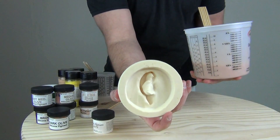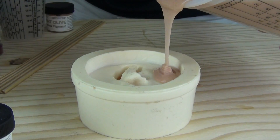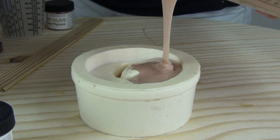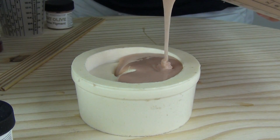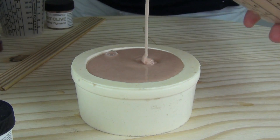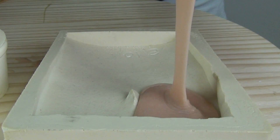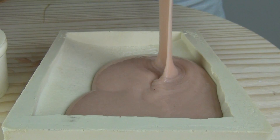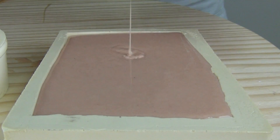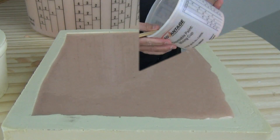5110F is a very low viscosity silicone with a mixed viscosity of around 2500 centipoise, so most parts like this we don't have to vacuum degas. But if you're doing really critical medical simulators, silicone dolls, and masks, it's always a good idea to vacuum degas — and there's more than enough time to do that within the six to eight minute working time. You can already see from the top of the pour those flocking colors and how they break up that otherwise flat look of synthetic material. The more flocking colors we put in, the more realistic our cured silicone skin is.